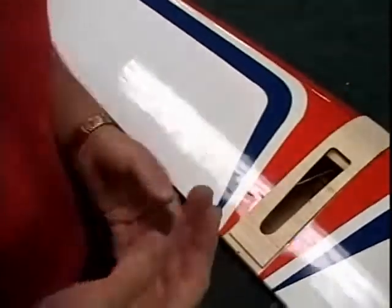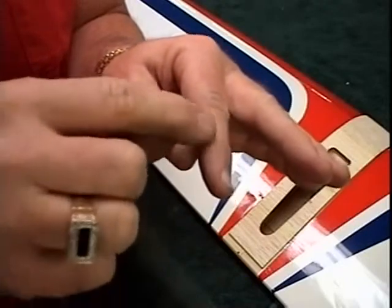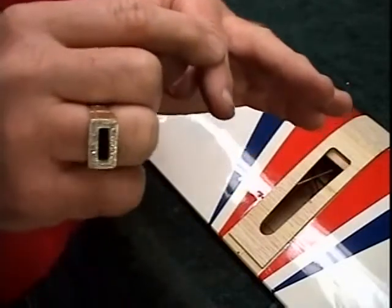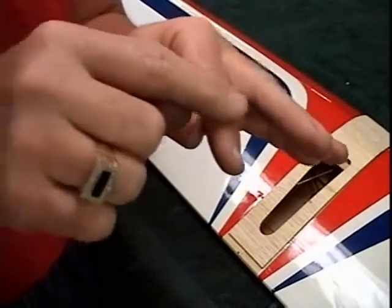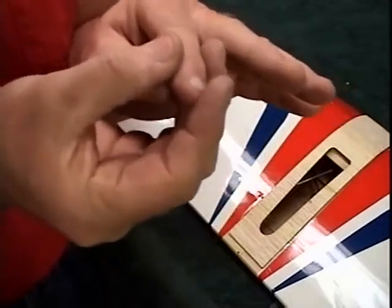This is really a critical thing. Where the bolt goes up into the plywood, they've put a nut. But there's nothing keeping the nut from getting loose. And as we use this model more and more, I want to get some epoxy, some glue, something in there, so that nut can't rotate. Now, if you look down in there, you see where that nut is? Okay, and then there's a nut up here. Well, I want that nut to be in some epoxy or some glue as a redundancy, and I want to see if it has a nut on the other side.